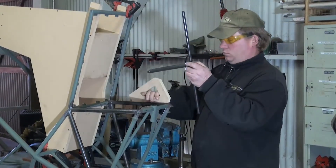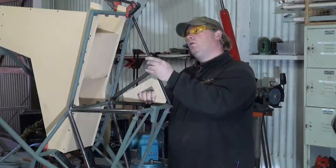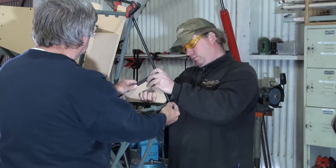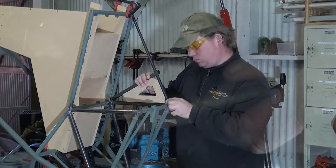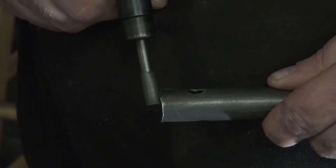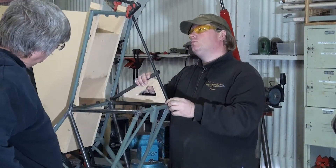The next step is to position both of the tubes using fixture 53-10-08. This will provide exact location for the placement of both tubes simultaneously. If there are any areas around the tube that interfere with proper positioning, we need to take a die grinder and make some minor adjustments to ensure a proper fit. Additionally, we need to think about any vent holes that may need to be drilled in the tubes before we finalize the welding.